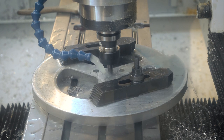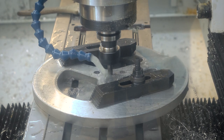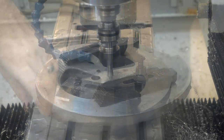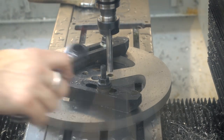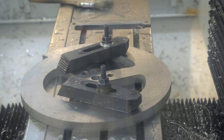Even though the first hole turned out okay, it was running really noisy — there was a lot of screeching and it just didn't really sound great — so I needed to make some adjustments for the next holes. I repositioned everything, used the rod once again to line up the next hole, and this has a slightly different CAM program because it's a shallower hole — this is for the low-profile countersink.